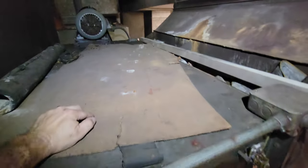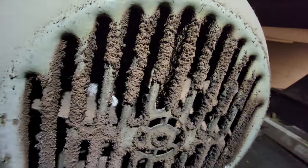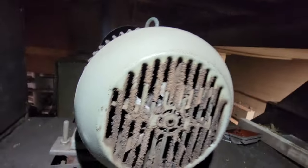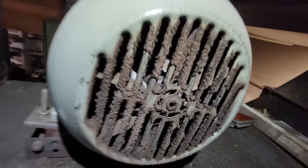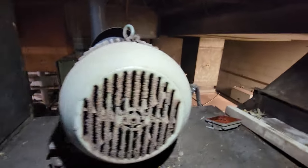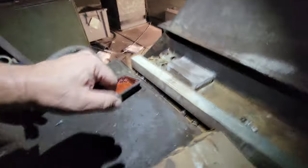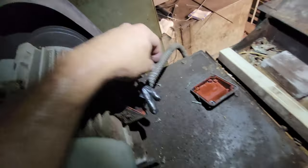You can see we had cardboard for some time up here. Okay, we'll get on over to it. Oh wow — look at the end of that motor, you can see the fan. The fan is completely broke loose from the shaft. So it probably got so hot that it freaking fried itself. Let's go ahead and get these isolated.